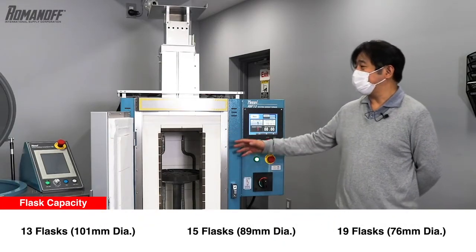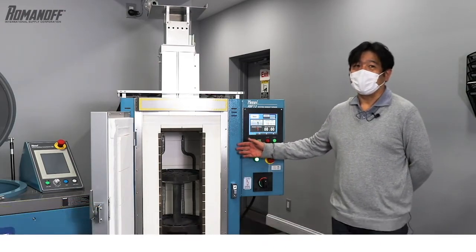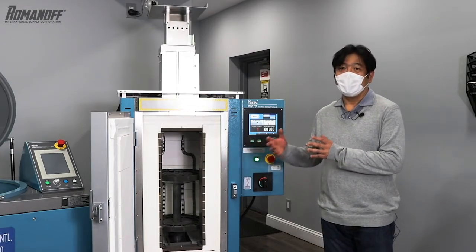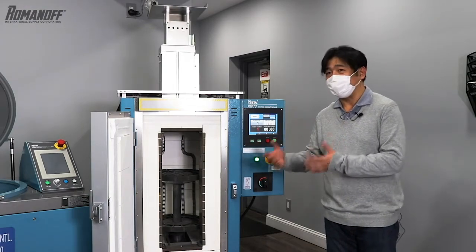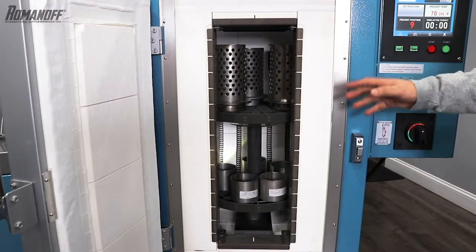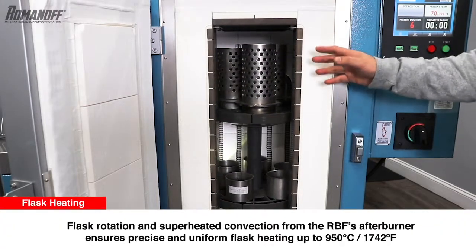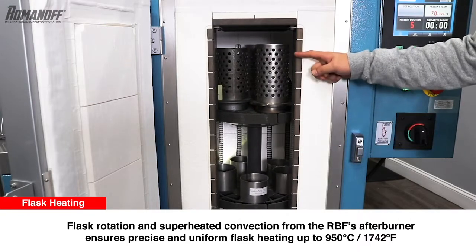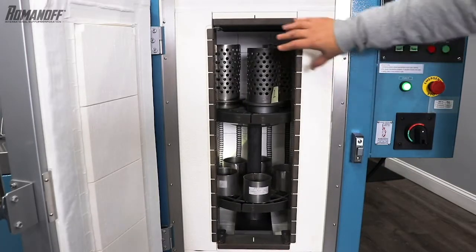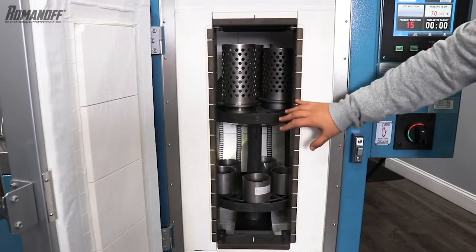The biggest difference between the static ovens and the rotary ovens is not only the final temperature of the casting, but the process of making a flask is very important. What is important about the furnace is the air circulation, which makes the heat temperature even. This oven works with both platinum and gold, going up to 950°C, and as you can see, this uniformly distributes the heat inside the whole oven.